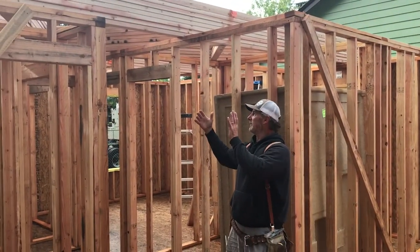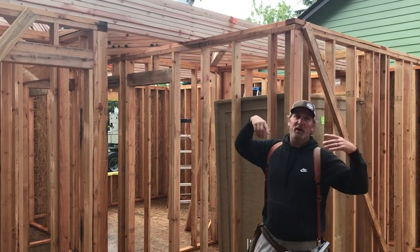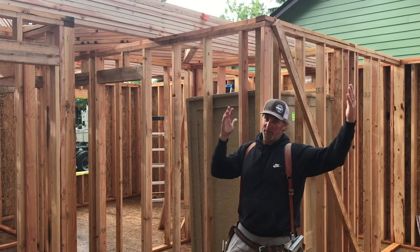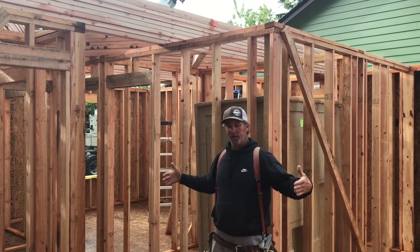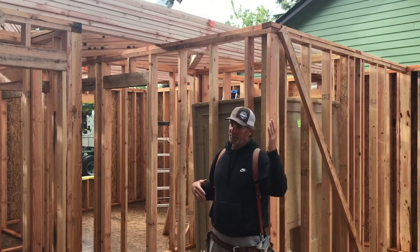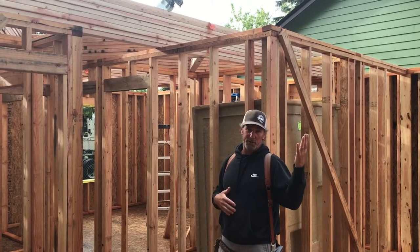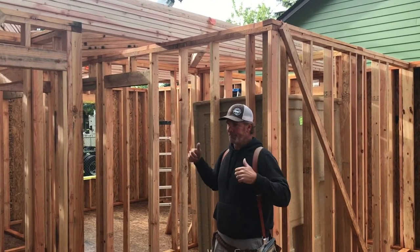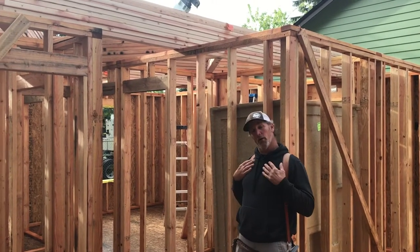I set the other bundle in the same orientation right next to them. So we can pull this gable off. Once we stand it, we can slide the next one, put it up, next one, next one, next one. When we get down to the end, we'll need 8 feet to put that last truss up. So we'll stand a couple trusses up out of the way, lean them against the ones we've already stood, sheet that gable, stand it, fill them in. So we'll be here tomorrow.